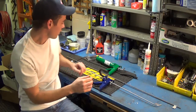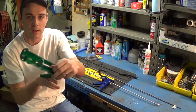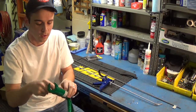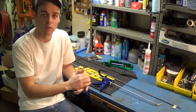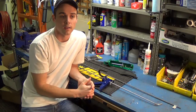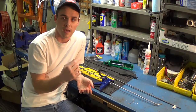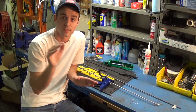Then you're going to take the little end that is on the caulking gun rod itself that pushes the caulk out — this little round end right here, held on with a nut. You'll take that end and place it over the new threaded rod, then take a small washer, put it over that, and finally another quarter-inch nut. That will make the end that presses against your pedal.